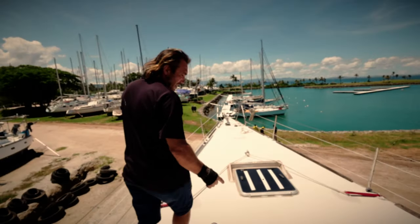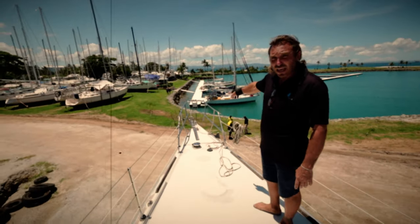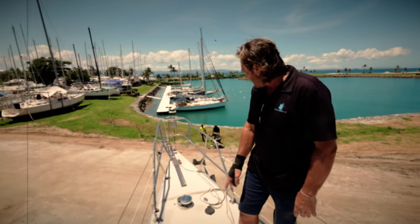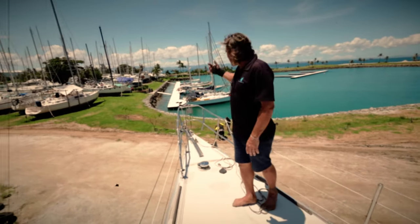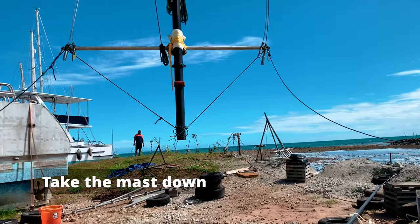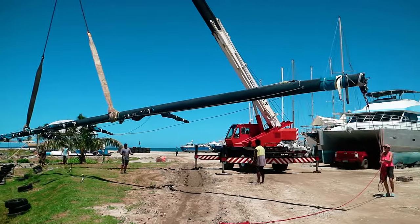At the moment we have two forestay sails here, and after we have the headsail on the end of the bow, and we want to add one stay approximately in this position. To have three jibs plus code zero and bowsprit. To add this new stay, we had to take the mast down as we needed to drill new holes in it to attach the stay to.